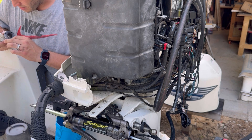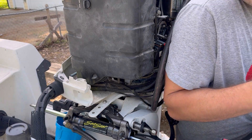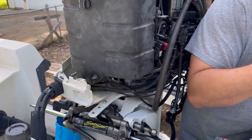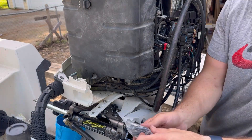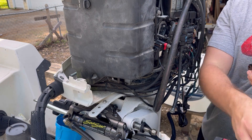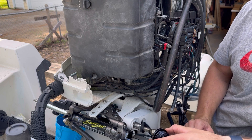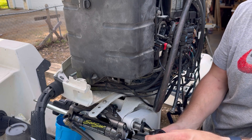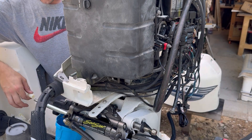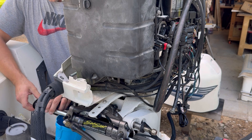This seal is not as bad. As mentioned, the kit comes with a nylon bushing to protect the threads. Slide it over here on the cap like that. Get some of the grease or hydraulic fluid on the piston shaft, slide it on. Use the nylon bushing, sliding it on - it's lubed up. Spin it a little bit.